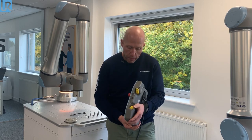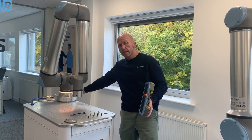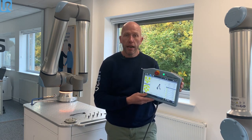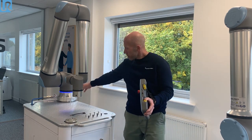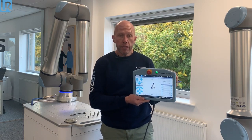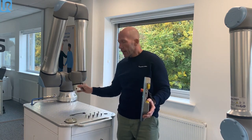With the 3PE switch activated on the UR20, if I'm not pressing the button I can't manually move the robot — we can see that on the graphics and on the status light, it's yellow. If I fully hold the button in, I still cannot manually move the robot and the status light is amber. If I single click, the status light turns to blue and now I can move the robot. For free drive, I double click and hold the button in, and free drive is now available to me.